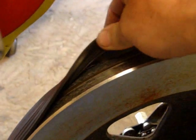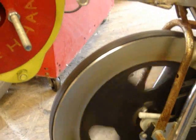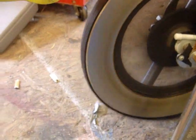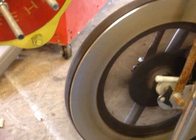I'm Scott Brown with Green Wind and other Home Energies. We're looking at an exercise bicycle here and we got the green machine sitting up here. We're looking at the rubber piece that we're going to try to drive this with. It's got a little notch inside here and a rubber belt on here. We're going to have to put some liquid nail in this thing to rectify the problem for those who want to make a pedal generator out of one of these. Go ahead and crank it up, Boomer, I'll show you. You can see that as it gets going faster it stretches out — it's not really on there tight and doesn't have very much friction. So we're going to put some liquid nail down in that crack and shove that tab down in it all the way around and let it dry for a little bit.